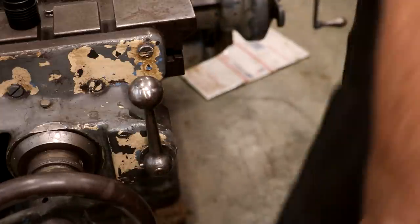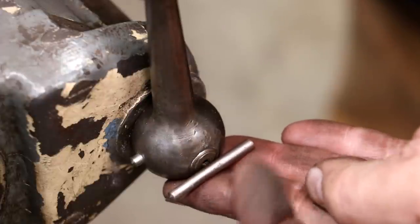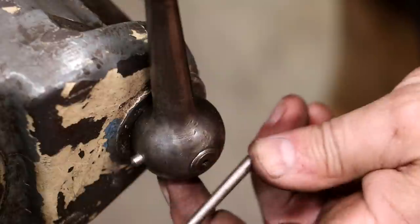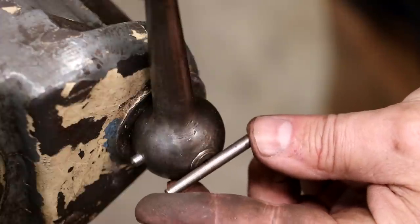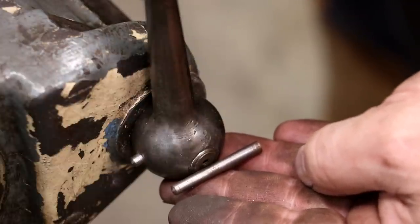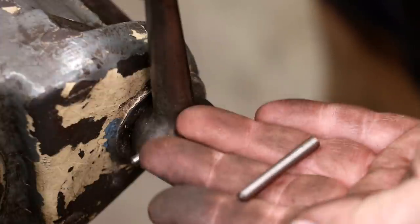That was a lot easier than I was anticipating. Let me show you — this is a number two by inch and a half tapered pin. It's smaller on this end than it is on the other end, so it'll only go in so far and it'll lock in place. These tapers are extremely strong — once you lock them in, you can take a hammer and knock them back out, but they stay in place really well. In a lot of more modern machines they use spring pins or roll pins — they're hollow on the inside. These are solid and a lot more solid. I think they lost favor because they're more difficult to get out, and it's also more aggravating because you need a reamer, not just a drill bit — there's an extra step. But it's the old school way and I like these. I see them a lot on this old machinery.